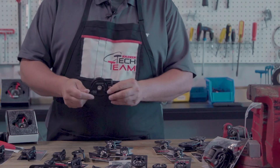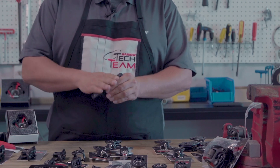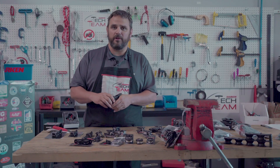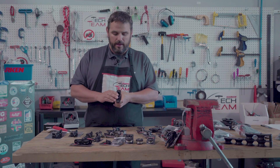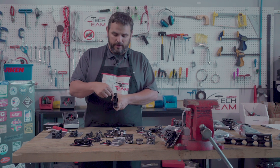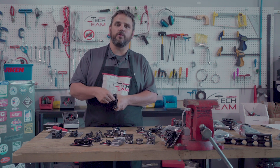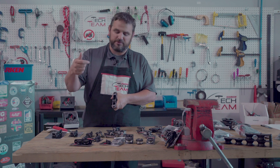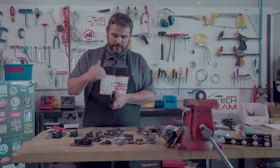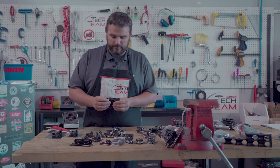The frame is a one-piece aluminum frame which has been hard coat anodized, which protects it from UV and protects it from the line wearing on it. The sheave itself is aluminum, which is nice because unlike a plastic sheave, it won't chip if a snap shackle from a spin halyard or jib halyard hits it — it's not going to damage it. It's also hard coat anodized.